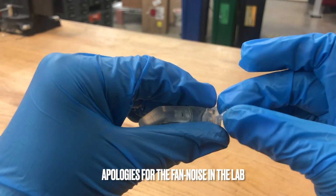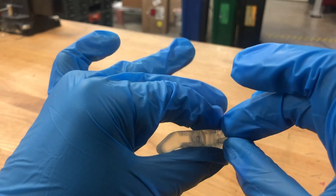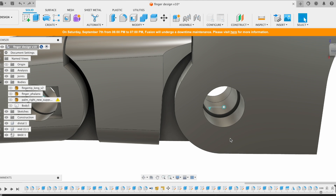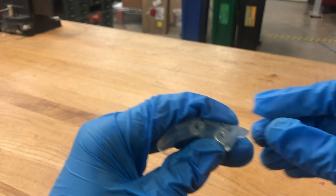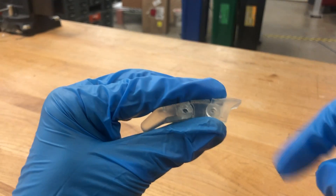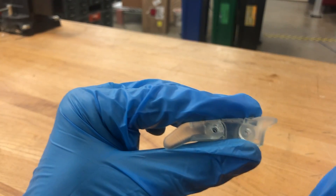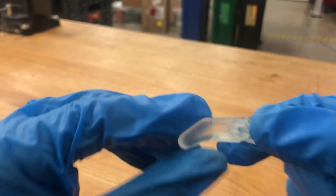The problem is that the pin I got from the Phoenix Hand doesn't really fit with the current design — probably due to an offset in my original CAD design on the newly designed finger. I'll have to remake this pin, but for now since this is a prototype, let's try using mechanical screws for the revolute joint and see if a rubber band and string can make the finger mechanism work.